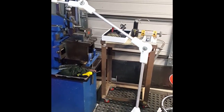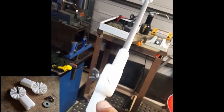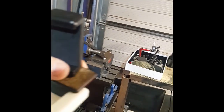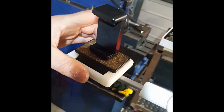So this is what I've come up with — just basic printed parts, all white because that's what I have in stock. The base just slides into where a camera would normally sit. We've got knuckle joints here and up here, and these have serrations so I can adjust them to any angle. I'm going to reprint those though — I need more serrations because right now it jumps from one position to the next and doesn't give me enough movement. At the top we've got the camera mount itself — I've copied the shoe mount and made a part for the camera to slide into.